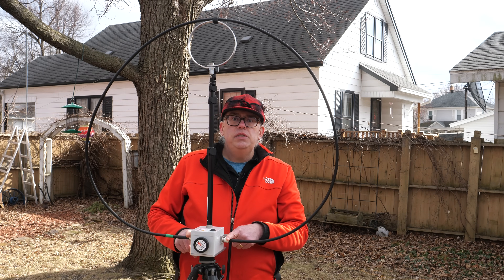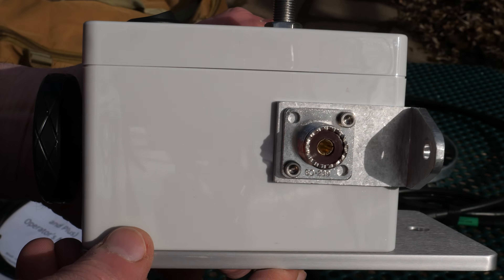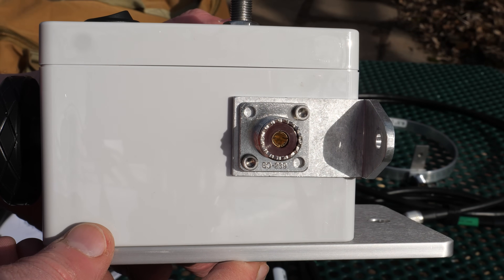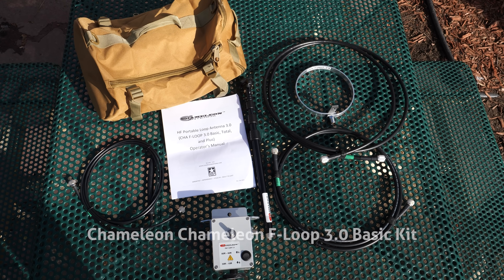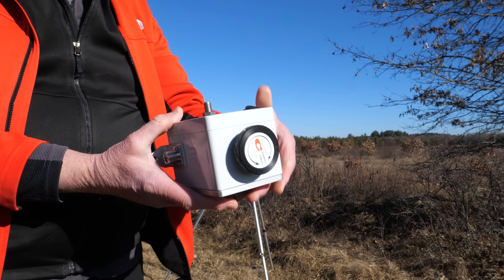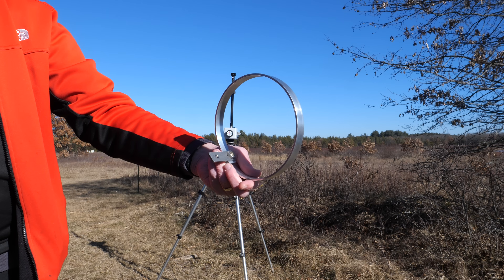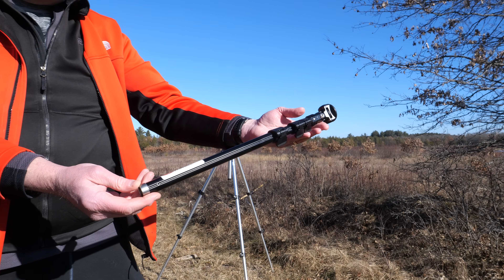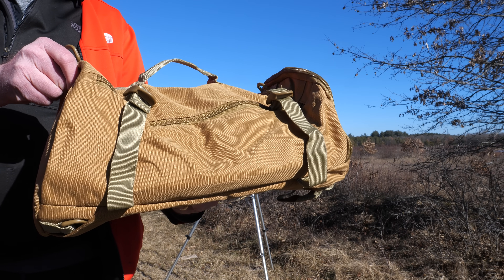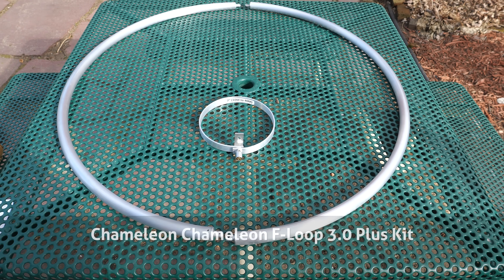On the sides of the tuning box are two sets of connectors — UHF female connectors for attaching coaxial cable for the primary loop, and two tabs for attaching an optional rigid aluminum loop. The F-Loop kit comes in three different configurations. The basic kit includes everything needed for 10 through 80 meter operation: the tuning unit, two sets of LMR400 coax cable radiators, a six-and-a-half-inch coupling loop, telescoping mast, 12 feet of coax cable with integrated chokes, one barrel connector, user guide, and a shoulder bag.